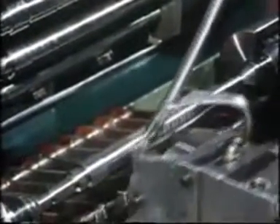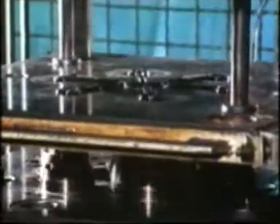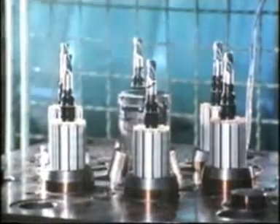Final buffing of the armature shaft. Cross fluting provides a grip for the longitudinal insulation. Armature shaft, armature plates, layer of insulation — the insulation between the shaft and the plates is perfect. The subsequent high tension test shows up even the tiniest fault.